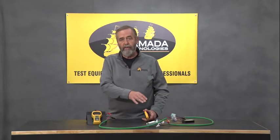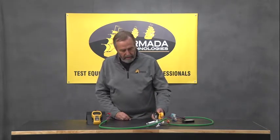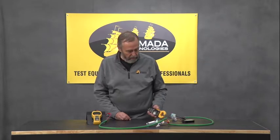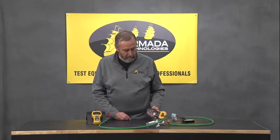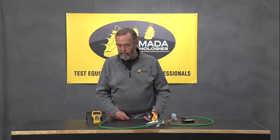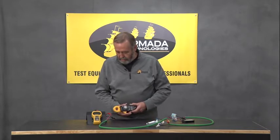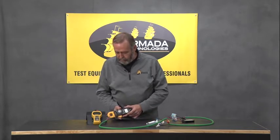This is now providing power on the cable using its AA batteries. I can go through the system checking the currents as I go, looking for too much current, too little current — signs that tell me that splices are bad, they've been disconnected, or there's water shorting things out in the box.